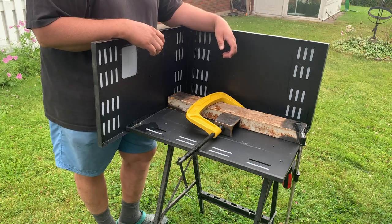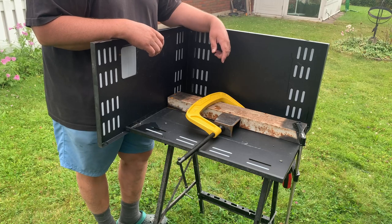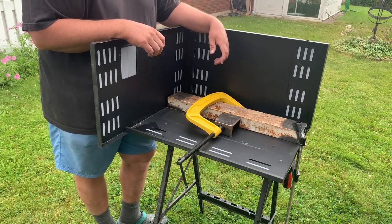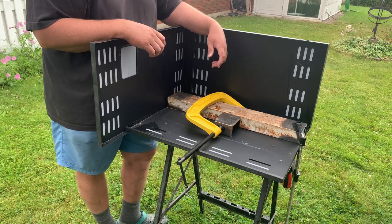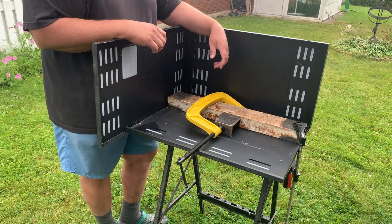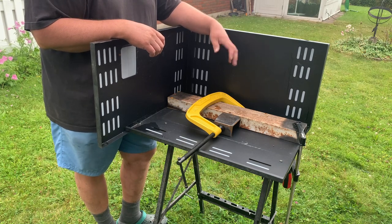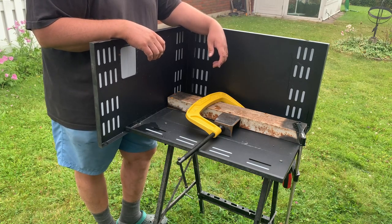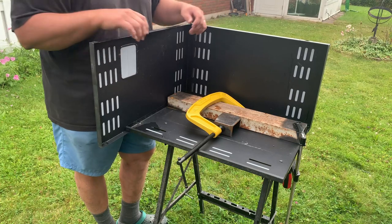So anyway, the idea is, when you're welding, you create an arc, and the arc dissipates ultraviolet energy around from the arc location, and that's actually not good for human beings or animals or children. So you want to protect your environment, so you're not sending that arc energy where it's not supposed to be. So that's usually why you have a welding booth.